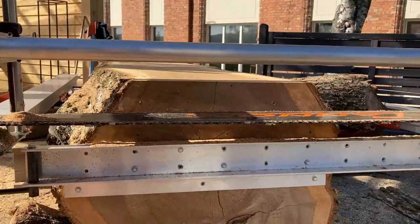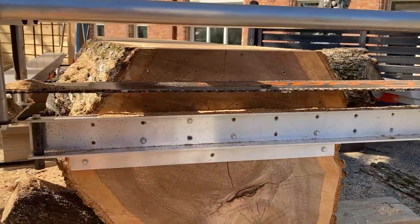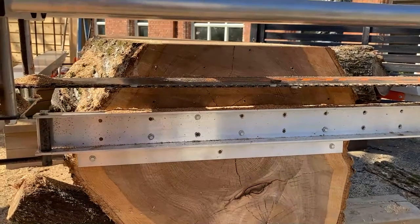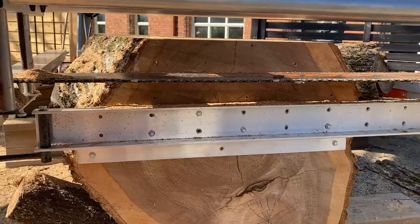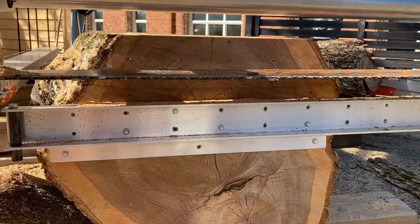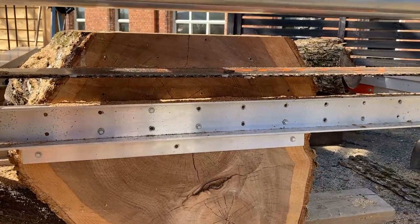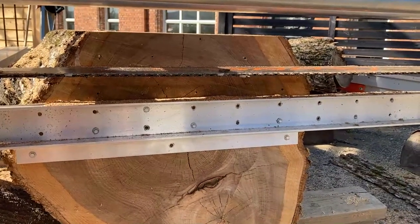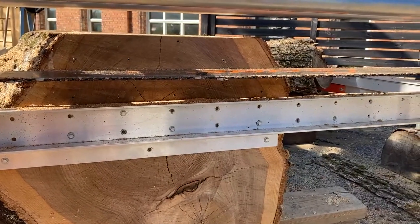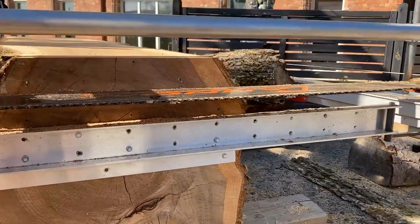and we have the end pieces that we connect on the end of the logs. We screw them into the log, and that is actually what's holding up the guide rails on both ends. And to reset it to the next height, it's really easy. We just put a board underneath at the correct thickness and just lower the crossbar here to the next height.